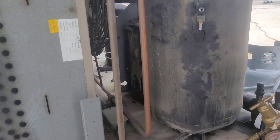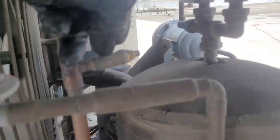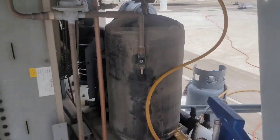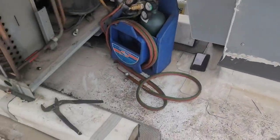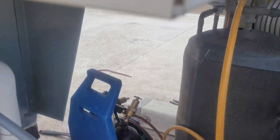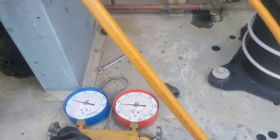I've got the valve on the discharge line between the compressor and the condenser, and the receiver valve right here - closing both of these valves isolates my condenser coil. Most likely on this system both valve ports are empty. There's this extra port right here - that's what this is for: when you isolate the coil you connect to this one. Once I'm connected to that, I'm ready to shut the unit down, close both valves - the one on the receiver and the one on the discharge line - to isolate my condenser, then begin recovery.